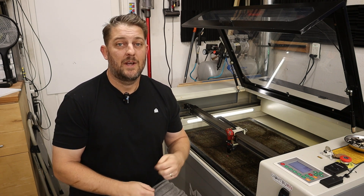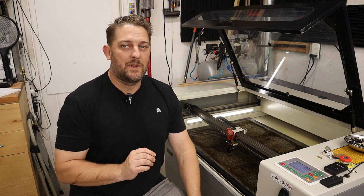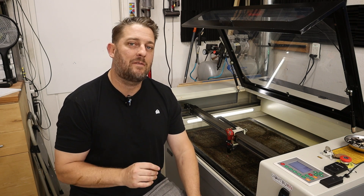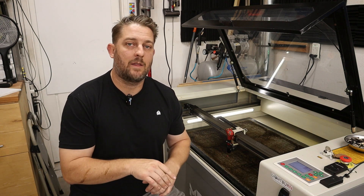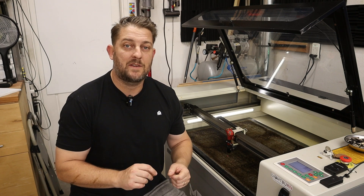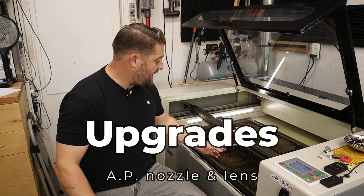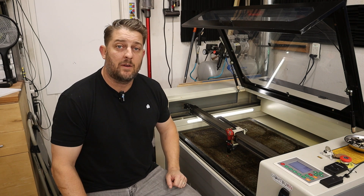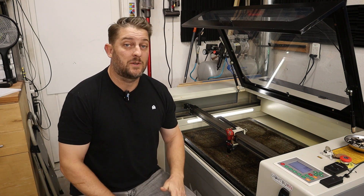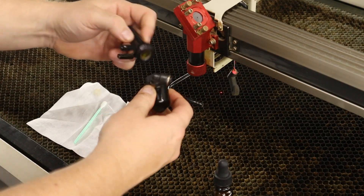I really like this upgraded air assist not only for the added cutting capability but also for the convenience of being able to toggle on and off the air assist using LightBurn. With the stock air assist, the air pump is constantly blowing out of the nozzle whether or not you have a project running — as long as the machine is on — and it's a little loud. The other upgrade I've done is changed out the nozzle assembly from stock to a unit from American Photonics. There's nothing wrong with the stock nozzle assembly, but this makes it a lot easier to swap between different focal length lenses and it's also a little bit easier to clean them.